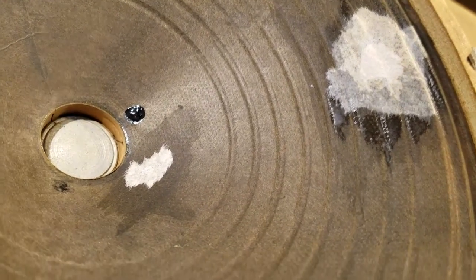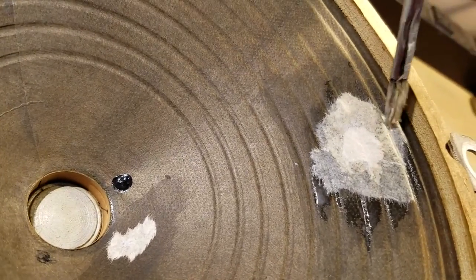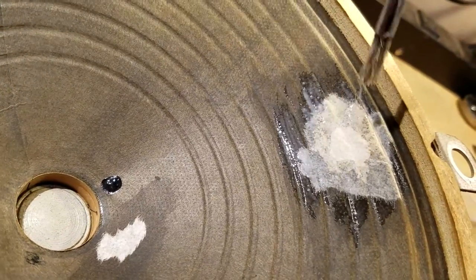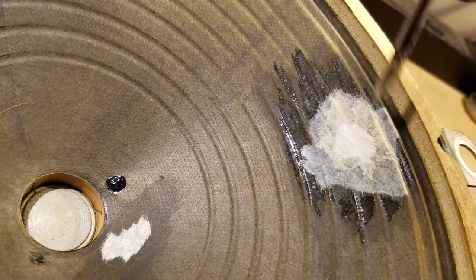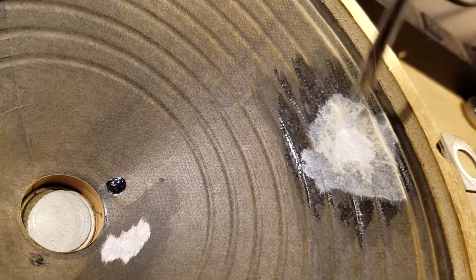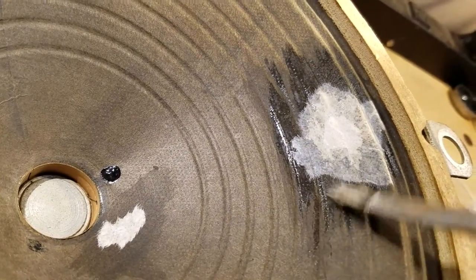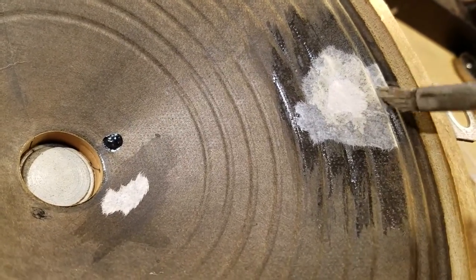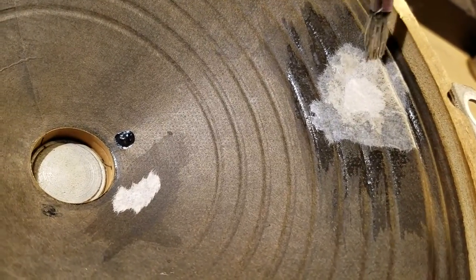You're not trying to be perfect here — we're hobbyists. This is good work that will last a long time. On the second pass you want to spread out a little farther on the speaker so you don't get a buildup in one spot. You spread out nice and thin as you venture out onto the speaker, so that you don't have a heavy spot there that would affect the way the speaker moves and affect the sound.